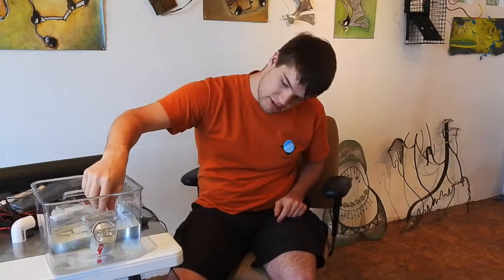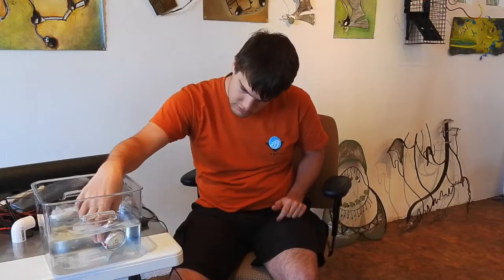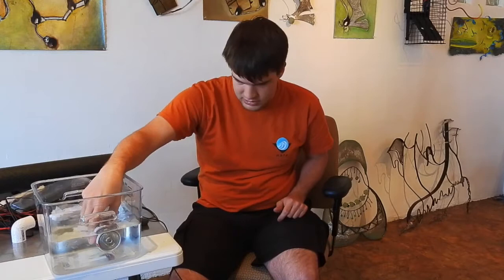Here's a practical demonstration of what buoyancy looks like. We've got a can of diet Coke — mostly water. If you put it in water, it kind of hovers in the middle. You can see one end is lifting up because the can is not fully filled with coke; there's a bit of air in there so it goes to the top. But it's not sinking very fast. You want it hovering just about in the middle — that's the main goal with the ROV.